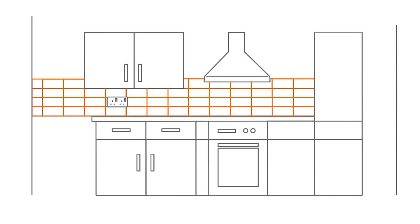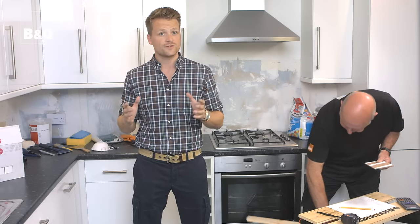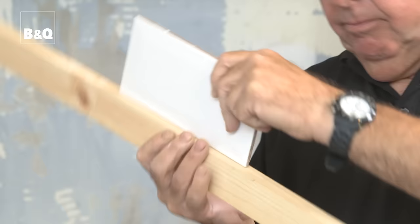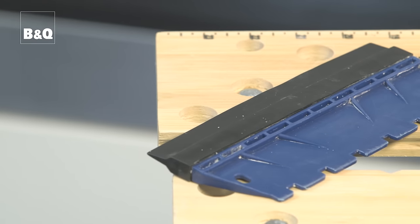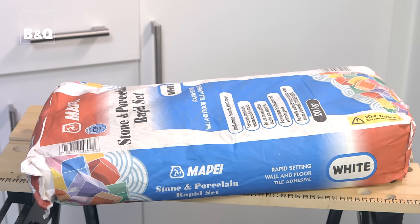Now we're ready to mark up. If you're tiling above a kitchen worktop, you should be able to tile straight above it as long as it is level and flat. If your worktop isn't level and flat, you'll need to fix a temporary batten to the wall — a length of 50mm by 25mm plain softwood, commonly called 2x1, is often used. Where a batten is used, it's normally fixed so that the tiling starts at the second row up, and cut tiles are then fixed in the first row after the batten is removed. Here we're tiling above a worktop which is flat and level, so no batten is required. As we're using ceramic tiles, you can use a ready-mixed adhesive. If you're tiling with porcelain tiles, you'll need to use the powdered variety.